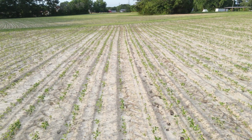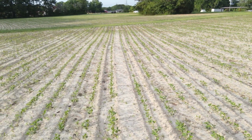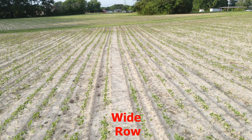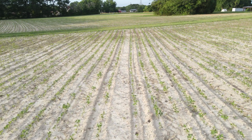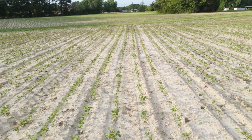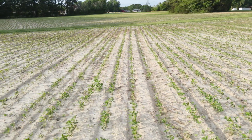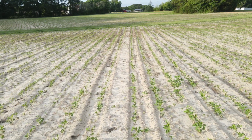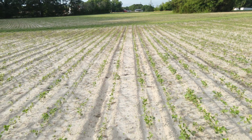But this planter, whole new experience for me. A whole lot more to operating a planter. There's another wide one. I didn't flag it up, went back to it right there. I said, yeah, there's another wide one. And it looks like, from what I'm seeing, is that one side that got yanked was too long, because I could go down and turn around and follow the other row marker back, and you don't see the gap. But you go, what would be two passes, go down, come back, and sure enough, there it is again, the wide one.